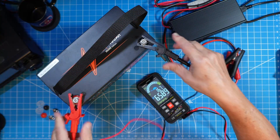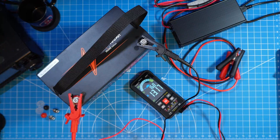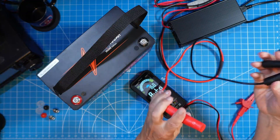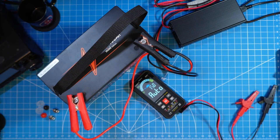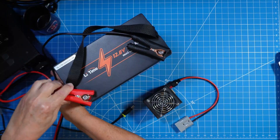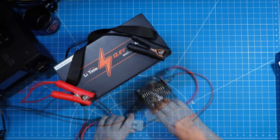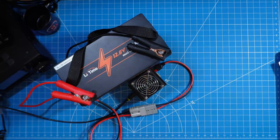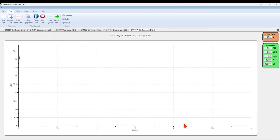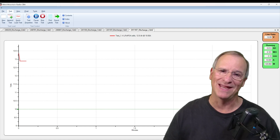Batteries like this typically come from manufacturers partially charged, so I'm confirming — 13.17 volts. We need to top this off. I'm going to connect it to my charger, get it completely charged, let it rest 24 hours, and then tomorrow put it on our analyzer and confirm that mini in size does not mean mini in output. I use alligator clips from Amazon with a 50 amp power pole connector, and this is the CBA5 — the West Mountain Radio computerized battery analyzer, one of the best you can get. At 10 amps discharge, this test will take more than 10 hours to complete.